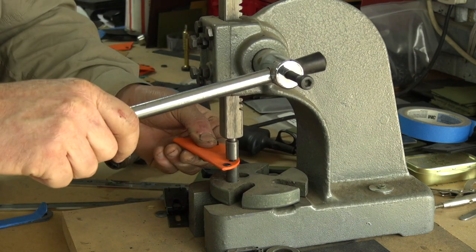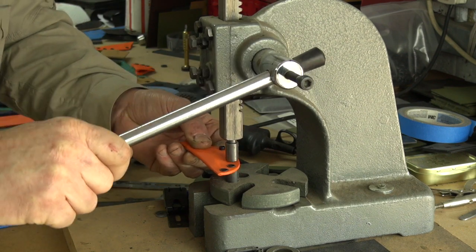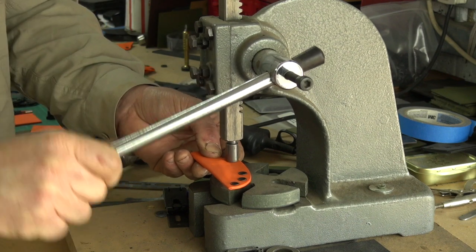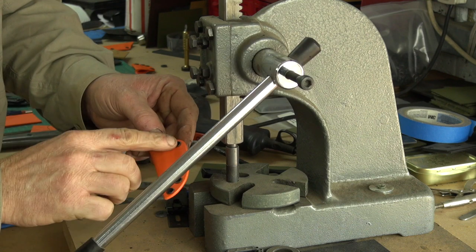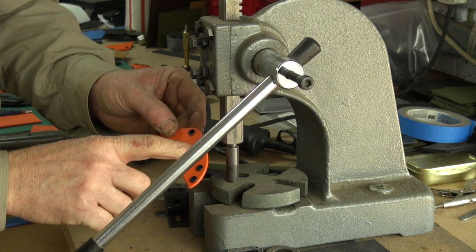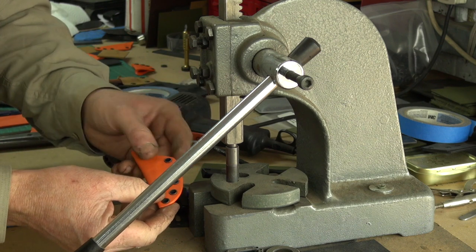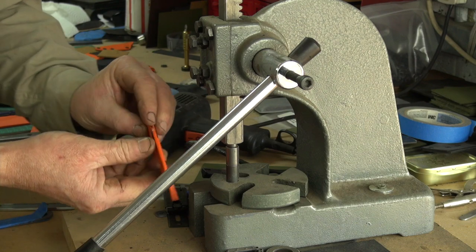You don't need a great deal of tonnage - this is a two-ton arbor press. You just gently squeeze it together and you can see it rolls over that eyelet - slightly smaller on the back side but that'll be perfect, and that'll be enough pressure to hold the two halves of the Kydex together. It's really annoying if you get grit or dirt on your tooling because those tiny bits of dirt can create scratches on your eyelet and then they split. Try and keep it nice and clean.